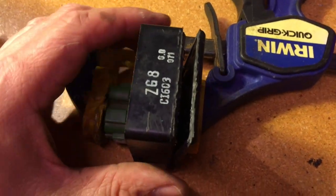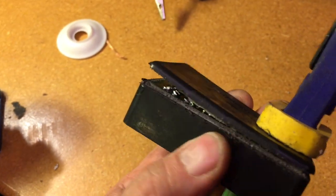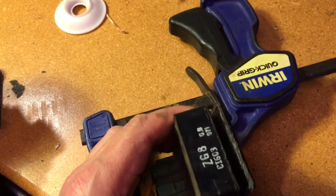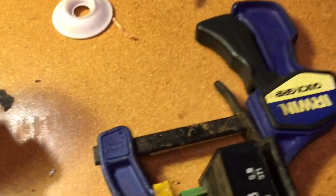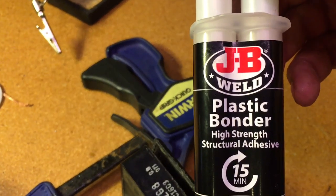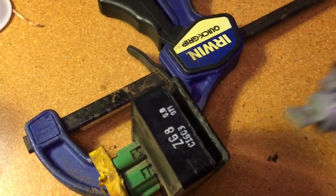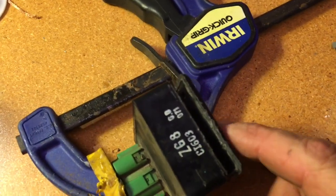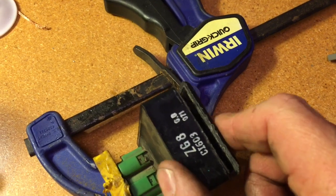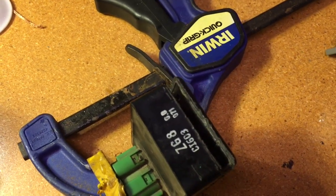At this point I've got everything soldered in a good way. I'm going to put a clamp on this and then use some JB Weld — the plastic bonding kind. I found this plastic bonder to be pretty good for resealing this. You have to get the top on pretty tight and pressed down quite firmly. You don't want any of the JB Weld to get on the inside — you just want it to cover the seam and make it watertight.